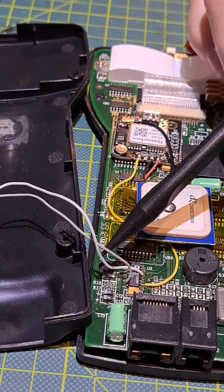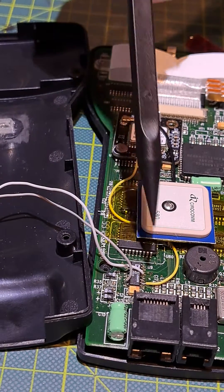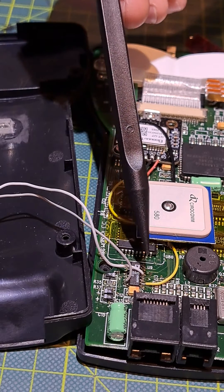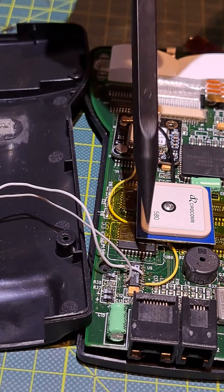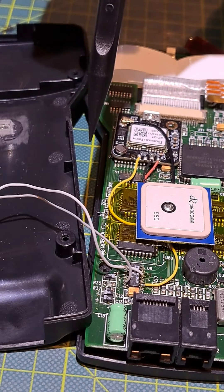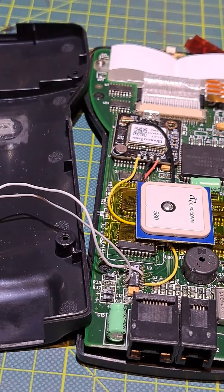Just to make sure you understand: in order to get this implementation to work, we have to be able to interrupt the jumper from pin 7 to pin 13. There was something with that jumper that was pulling the data line low, so no data was getting through. We just have to interrupt it and everything's fine.